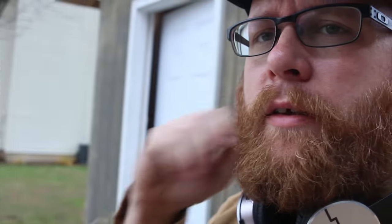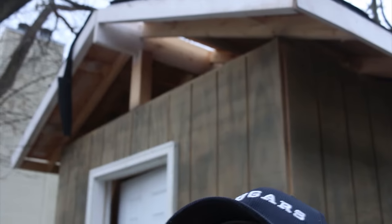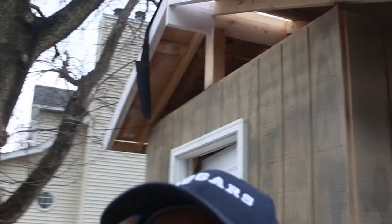It's another day making more progress. I don't remember my last update if I showed all the progress I made — probably not because it's usually dark by the time I'm done. So let's check it out. You can see I got some stain on the siding. Not a big fan of the color, but it'll at least do for getting me through the winter. I installed the door, so that was pretty huge. I've got the trim all around the roof. Right now what you see is some tar paper that's gone down on the roof. I'm getting ready to put the drip edge on — just racking my brain trying to figure out what I did with the tin snips. The roof is finally going on. It's long overdue and I can no longer procrastinate it, so that's what I'm going to get done today.